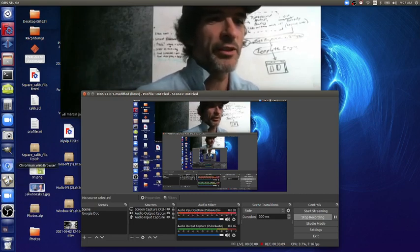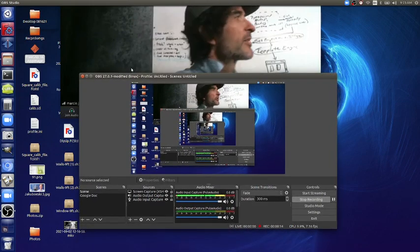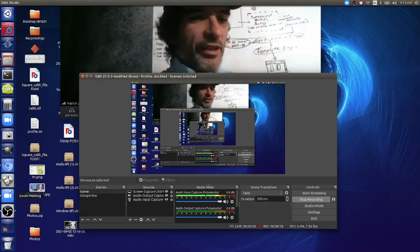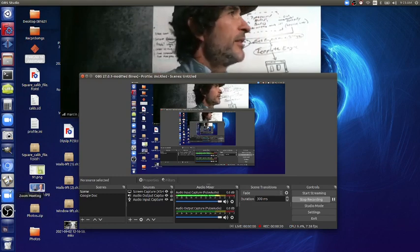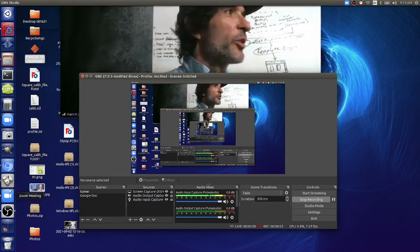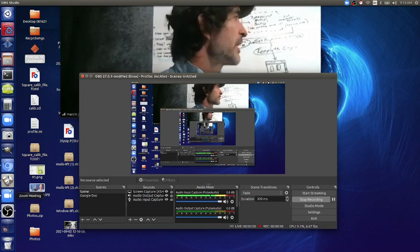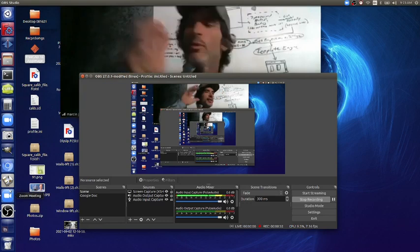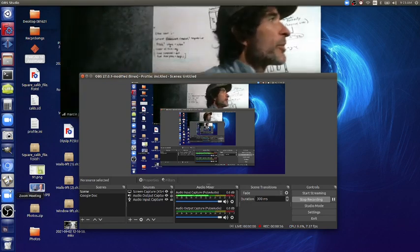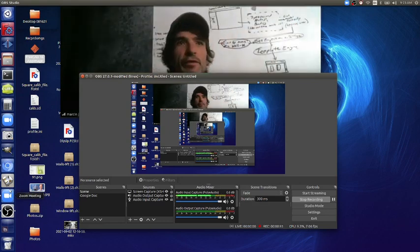All right, so yesterday we started on the walls. So that was good. We actually proved out the concept of the DIY structural insulated panel. At the end of the day, we took two panels, put them on a sill plate, and it worked really well. The way it looks right now, we can expect about 5 minutes per panel, if you've got the finished panels. I mean, it was easy.